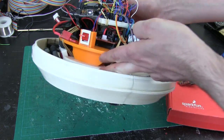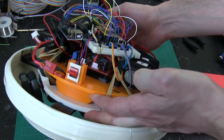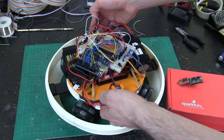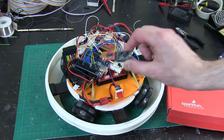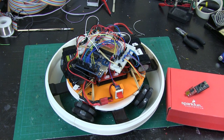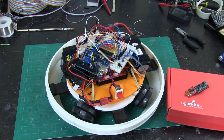The motor controller itself is hidden underneath that breadboard — the red board in the bottom there is the SparkFun Rover 5 board, which is conveniently a four-motor controller board. It works where it only needs four PWM pins for speed and four digital pins for direction. These Arduinos generally only have six PWM pins, so we'd need a Mega for more. However, the Rover 5 board only goes up to 12 volts, so I'm going to experiment with running the motors faster.